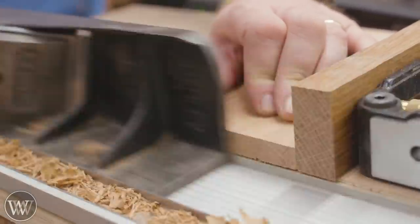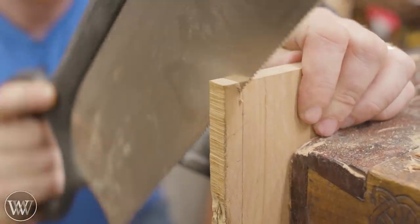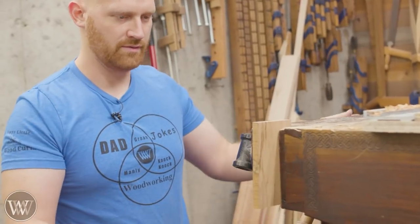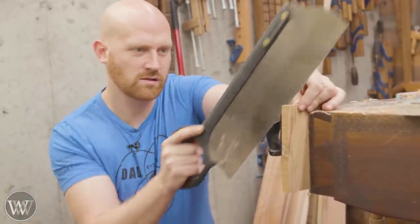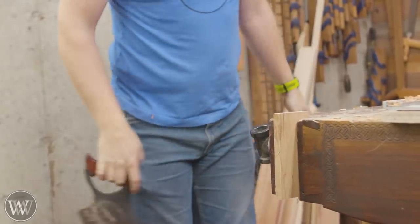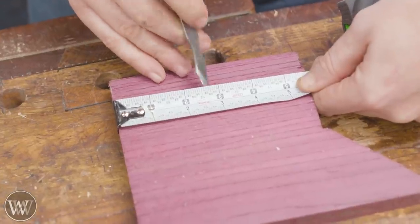You'll notice that later we have to super glue a piece on. We can shoot the other end nice and square and then rip it down for the last side — that's where I'm hoping to get rid of most of that. Using a tenon saw, which is a rip saw with a little bit deeper cut, I can cut halfway down, flip the board over, and then cut from the other side to get all the way down. And it is important to chew your tongue — it allows you to give very accurate cuts. Chewing your tongue is incredibly important.